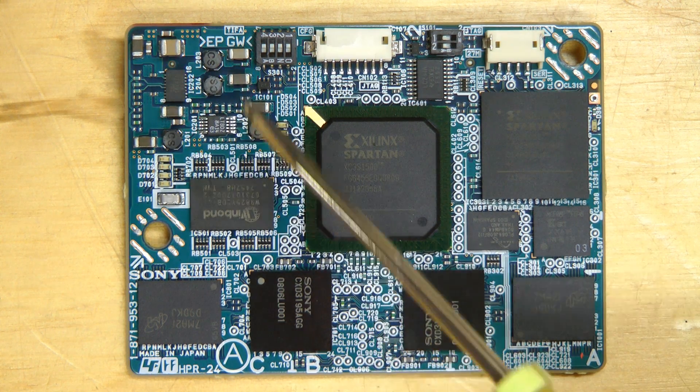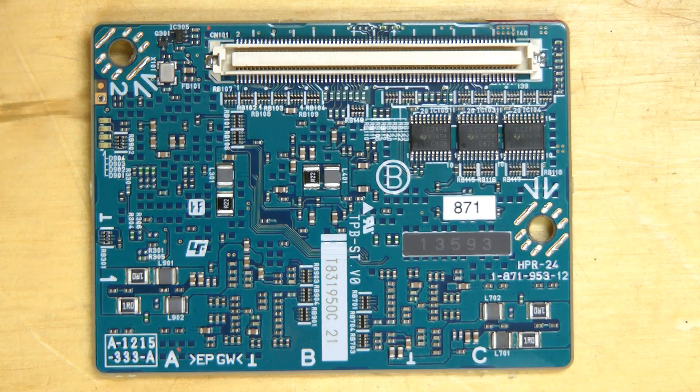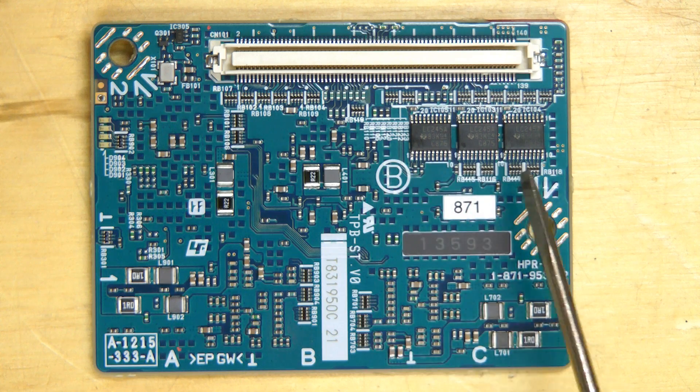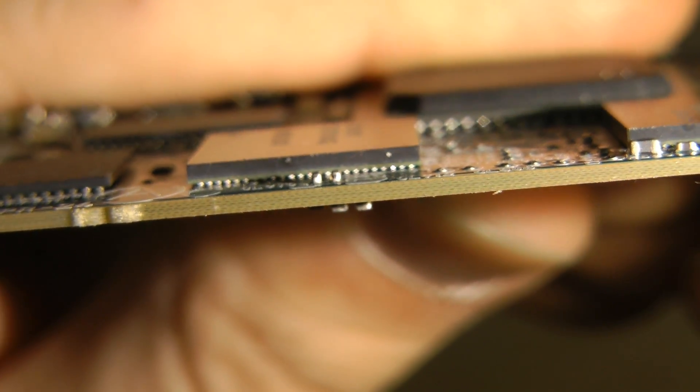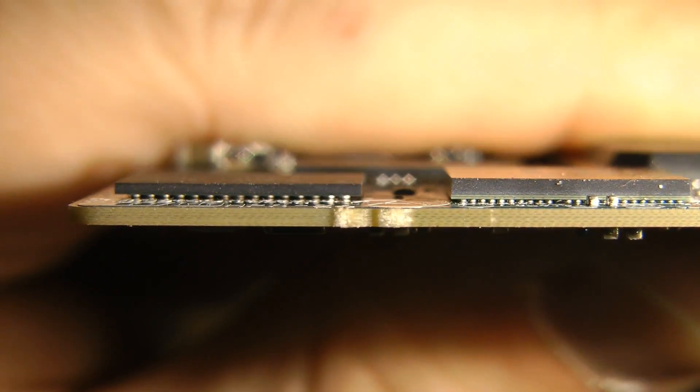This section over here is just power supplies. This board is also pretty high technology — they have a lot of micro-vias and very fine traces, and a lot of the vias are blind, meaning they start from one side of the board and don't go through all the way. The other side is quite boring — just bypass caps and some level shifters. If you look under these Sony chips, they're a pretty fine pitch: looks like 0.5mm or so, compared to the 0.8mm probably on the RAM.